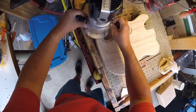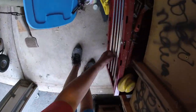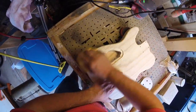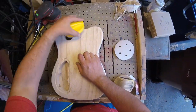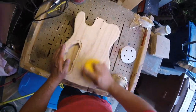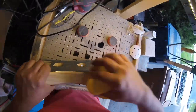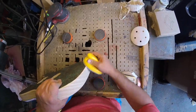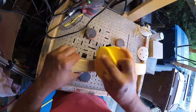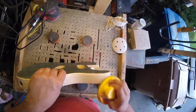The reason I'm doing the round over on the back and the chamfer on the top is because it leaves a much better finish for me to sand. A round over on the top would be sort of odd — I wouldn't be able to go down the full way. With the V-bit angled chamfer I get a much smoother surface, and as I'm sanding I can actually sand this down and put a little bit of a round over on the top. I've got all these different foam sanding blocks and I start with 220, sanding out any lines or marks from the bearing.